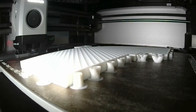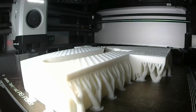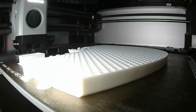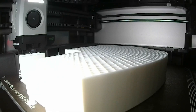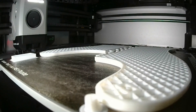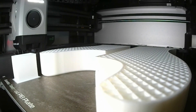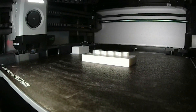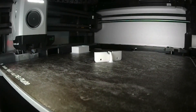The body in this video was printed in Bambu Lab PLA Basic, but you can use other materials if you want extra strength or improved thermal properties. Keep in mind that standard PLA has a heat deflection temperature slightly under 60 degrees C, and therefore it's not recommended to leave your 3D printed guitar in a hot environment, such as the trunk of a car on a hot day, as it may compromise the material and cause warping. You should also aim to keep your guitar in a relatively dry environment with low humidity, and you can consider using higher temp and UV resistant materials such as ASA.